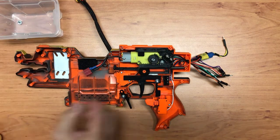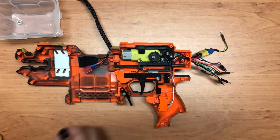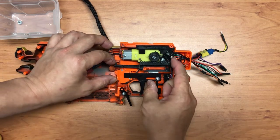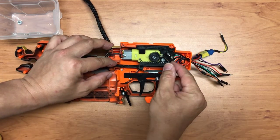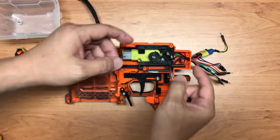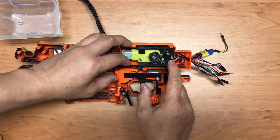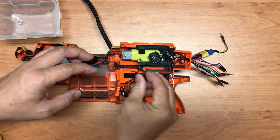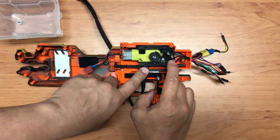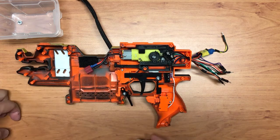Now, why do I want a bigger spacer over here? Again, when I was testing the system itself, I realized sometimes this guy got flexed out in this manner. So you will not be able to extend all the way because it was able to flex out. If I use the small spacer like this, there's a tendency that it might flex this way, and then it will just slip, and then it will not be able to extend enough.